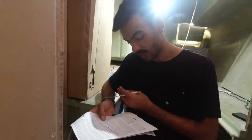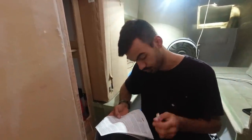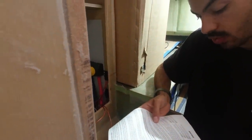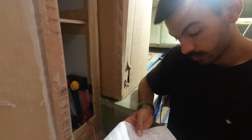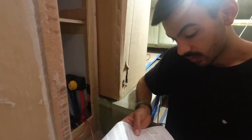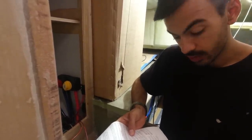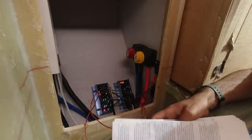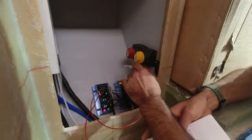Once the regulator is on and scrolling, touch and hold the magnetic end of the programming screwdriver to the red dot. PRO appears — it's in programming mode. BA appears — that's battery type. Now it's scrolling through the different battery types. We need to select the right one. We've got the manual and we're going to RTFM for a change and go through the basic programming using the preset battery codes.